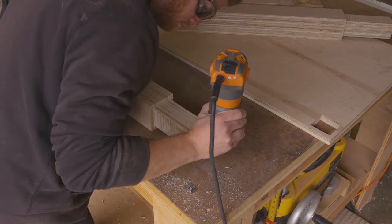To make the ramp attachment support, I glued up a block of plywood and cut a three-quarter inch dado in it, then cut a 45-degree bevel on the front to allow clearance for the ramp. Once the ramp support was dry, I took it out of the clamps and gave both the ramp and the support a quarter-inch round over to match the bed platform. To glue in the ramp attachment support, I aligned it to the front edges of the leg and the platform, then used plenty of clamps, making sure not to apply too much pressure to cause the support to become misaligned.